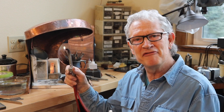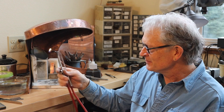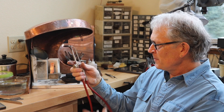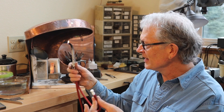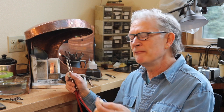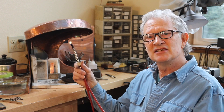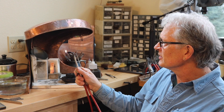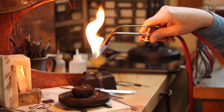Here I am with my favorite torch of all, the blowpipe. This is a German-made blowpipe, made by a family in Germany who specialized in these types of torches. It runs on propane and the oxygen is supplied by my lungs. It gives me a variety of flames, but it's really a very nice reducing flame that I use for granulation and annealing, and also for all types of soldering like silver and gold. You can get a focused flame and even get the flame hot enough to melt small amounts of gold into balls.